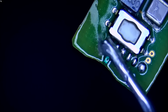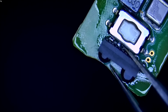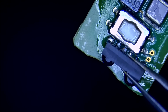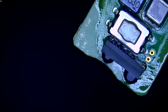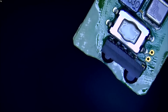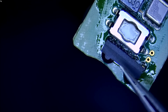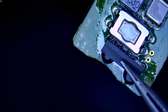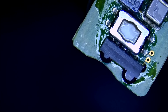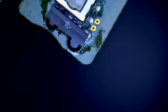Now the real deal — we need to apply flux and solder that connector. This is why we don't apply low melt solder — maybe we should call this video 'when not to apply low melt solder' — not enough room. I'm applying heat from the bottom and waiting until the component settles into place. The component is soldered on perfectly.